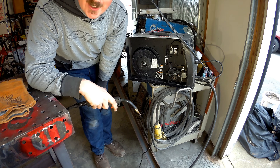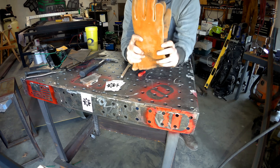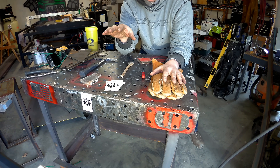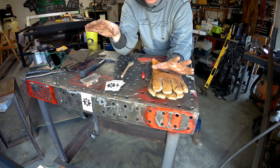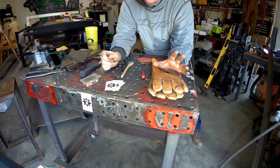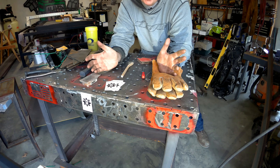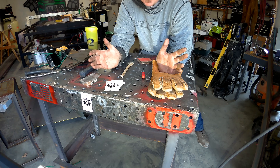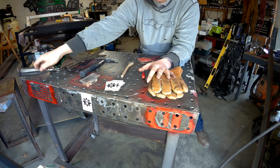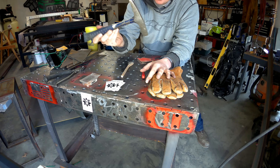Safety-wise: safety glasses first, and you're going to need some nice leather gloves — these are insulated. You're going to get burned doing this, there's just no way around it. You're probably also going to look like a degenerate after a few years of doing this. The other stuff you're going to need: just a few basic tools. I recommend a good pair of side-cutting pliers and a nice chipping hammer, because flux core does produce slag just like stick welding.